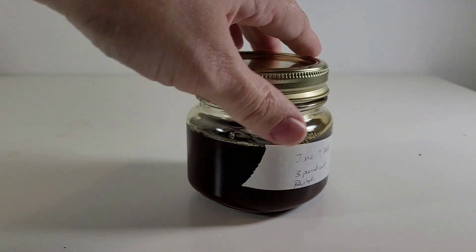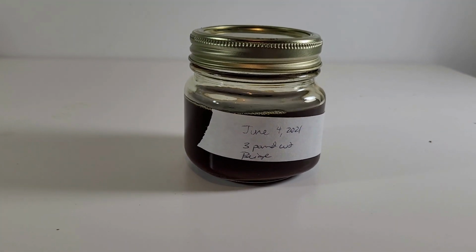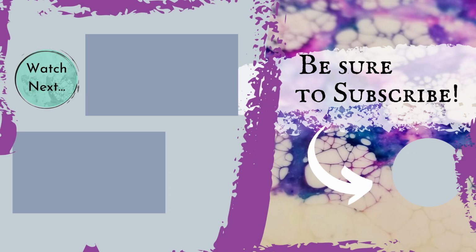So I'm going to mix it with some colors. Alcohol ink is a great way to color your shellac. You can also use dry pigments. With dry pigments, you have to be really careful not to add too much because you don't want to dilute the concentration of shellac. But those are two great ways to add color.